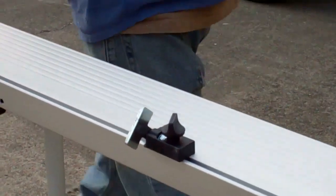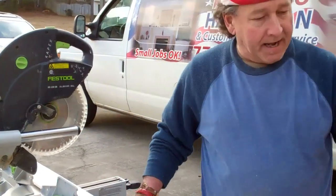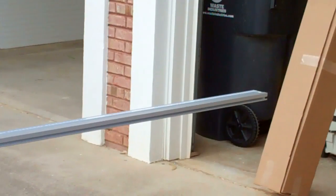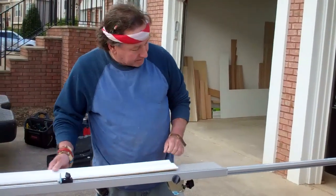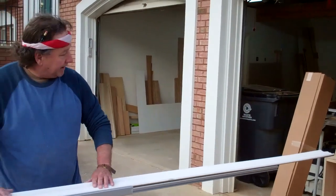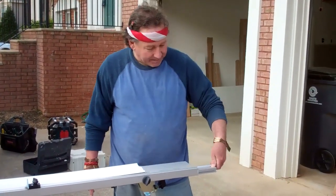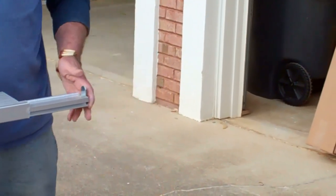Let's say you've got some long molding and it needs some support. The wing out here is about four feet long. What you can do is undo this little knob and pull out an extension. This extension adds about another three feet to the wing, so it will support extra molding out here, or if you need to cut a straight edge on one end. If you don't need it, you just tuck it back in. Another feature is an additional stop on the extension, so if you want to make repetitive cuts on longer pieces, it has a stop for you to set up and do repeat cuts.